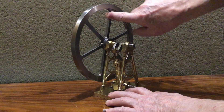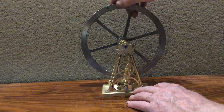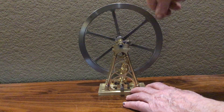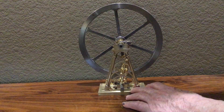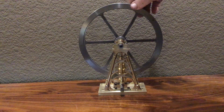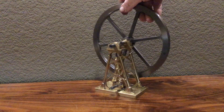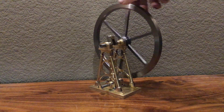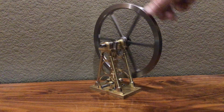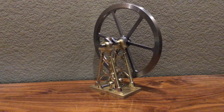Once I've run it a while under power, it'll probably be pretty free-running. You can see the action of the cylinder — there's a valve that goes in this hole down here, and it'll be attached with one arm to the base so that as the cylinder swings back and forth, it'll feed air to the top of the cylinder and then to the bottom. I still have quite a bit of work to do on the valving and the air passages to get it running, but at least it's assembled mechanically and it does turn over. I'm very pleased with the way it performs. Thanks for watching.